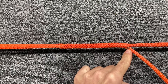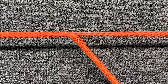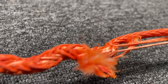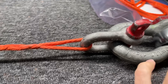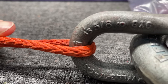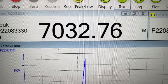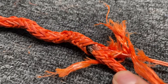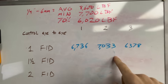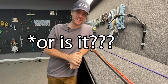6,700 pounds. For the second one I'm adding a marker here to see if it slips at all. I saw it getting sucked in maybe a quarter of an inch but it did hold. I'm putting this around a five-eighths inch shackle on both sides just for reference — the eyes are not breaking and this is the weak point where that comes out. That's not bad. It's predictably breaking there. That's our lowest result yet. So these are all over what Samson said would be 70% of average breaking strength, but you can see there's quite a bit of a range just between these two. I should have started with the two-FID bury because it's obviously going to be strong enough.